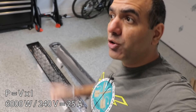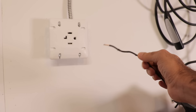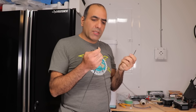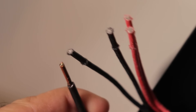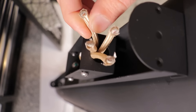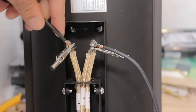These are a total of 6,000 watt resistors on 240 volts, which means 25 amps. Luckily, I installed a 240 volt outlet here on a 30 amp breaker. I can plug them in. And I have some 10 gauge wire here I could use, but no plugs. Although these wires are so thick I can probably just directly connect them. You must always make sure to connect the other end of the wire securely before plugging anything into the power lines. So each unit comes with a pair of live and neutral wire connections, one per element. So you have the option of turning on only one element if 3,000 watts is warm enough for you. Infratech has picked 12 gauge wires, which is more than enough since each element draws 12.5 amps. Bromic has picked even thicker wires — each one is enough to run the entire heater, that's why they are much less flexible. Here I'm going to hold the wires together with some alligator clips, which is quite a dangerous thing to do, but this is a lab test setting.